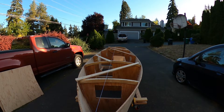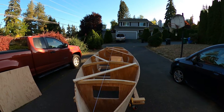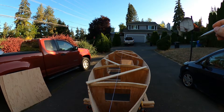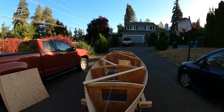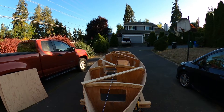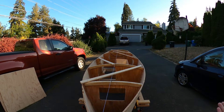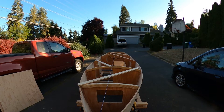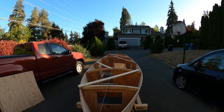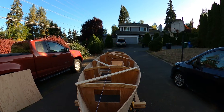I also learned I need to thicken the epoxy, especially when working on vertical surfaces, much more than I have before. I have a little bit of slump in the fillets, but I don't really see anything too structurally concerning — it looks like very solid joints there. A lot of the epoxy joints I'd been doing before were all on a horizontal flat surface on a bench until I came to this point. With the slower hardener and the vertical surfaces, I did get some slumpy movement of the epoxy, so it'll be some cleanup and sanding related with that.